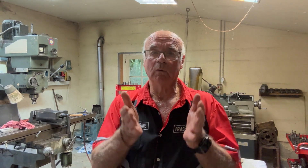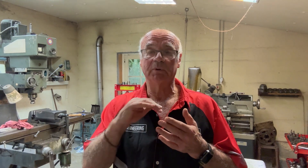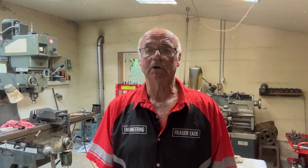Well, that was quite a big job in the end. I couldn't get the keyway cut in the normal way because we were going into an inverted cone. So what I had to do was cut a slot through the workpiece itself and inset a piece of 10mm steel welded in place, and that formed the keyway. I hope this explains everything - it was a bit complicated but it turned out okay in the end. If you enjoyed the video please subscribe, leave any comments, and look out for more videos in the future. Goodbye.